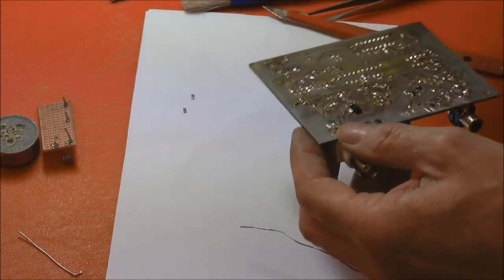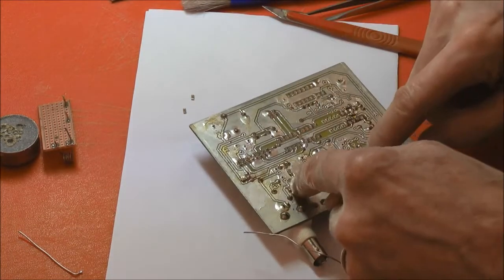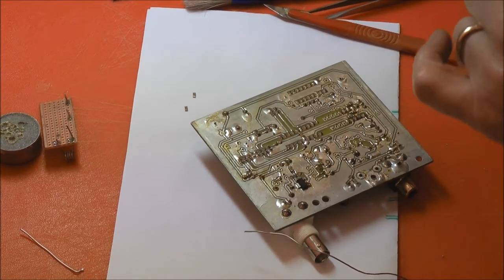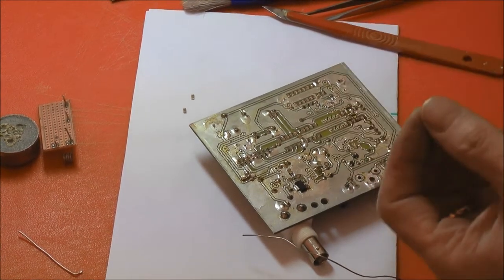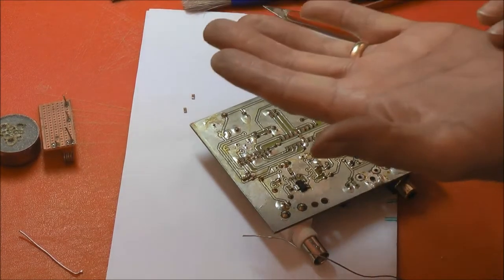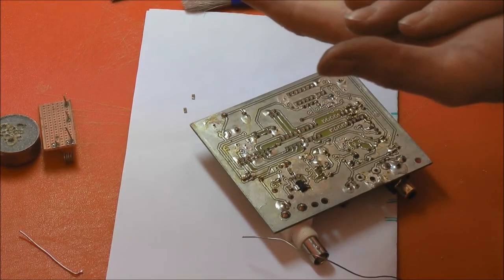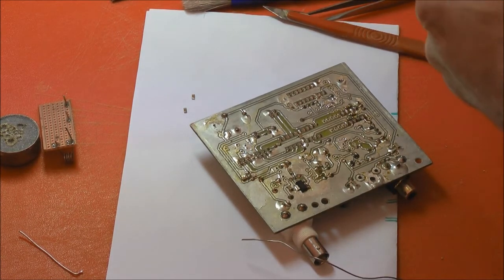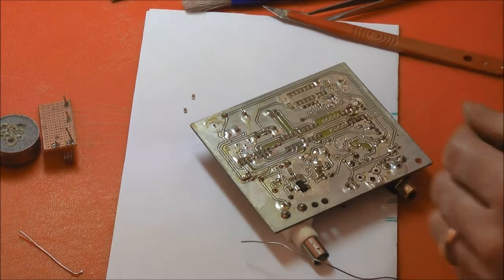Yeah, usually. Sometimes, like this has got effectively where the collector is, they'll use a connector there so it acts to draw heat away, because in most of the devices the main substrate is like the collector. So you see a lot of the old TO3 transistors, and the case is always the collector, and that's clamped to the heatsink with a mica washer or whatever.